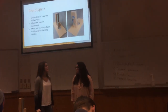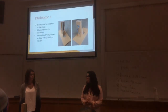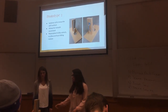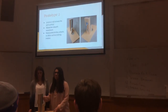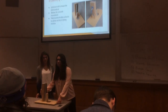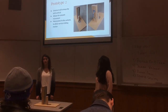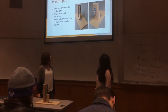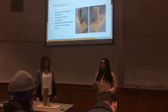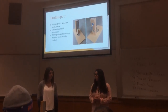With Unistrut, we're able to keep the drill vertical. It's really sturdy and it's metal. We were really concerned about how heavy this is going to be, but actually the only heavy part is the Unistrut and it's not that hard to lift up. It's really easy to move around, and with the handle, if they have trouble grabbing onto it, they can use the handle to support themselves. The Unistrut allows for really smooth movement. The only issue is deciding whether to use metal plates or trolley wheels for the final product, but a lot of the trolley wheels are kind of expensive, so the sliders might end up being our final solution.